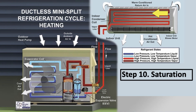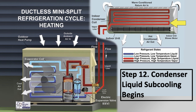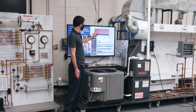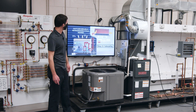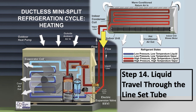It's just the reverse of what normally happens. Then you have the saturated state where liquid and vapor both exist at the same time. Say this is 100 degrees here and 70-degree air is being drawn in — it's going to reject heat and produce maybe 90-degree air coming out. The refrigerant then turns into a completely liquid state; that's your subcooling. You still have high-temperature, high-pressure, subcooled liquid refrigerant coming back to the outdoor unit.